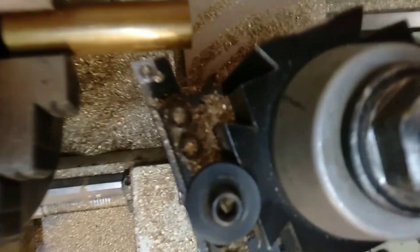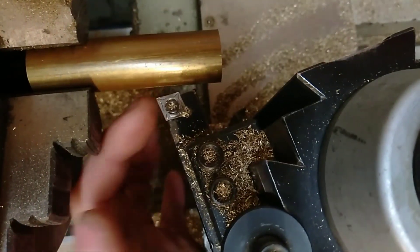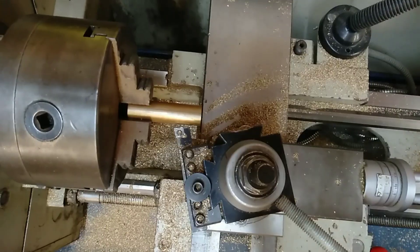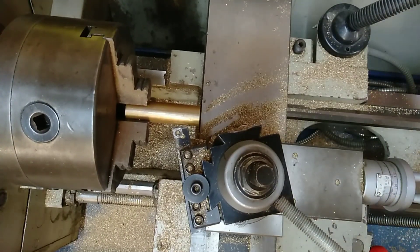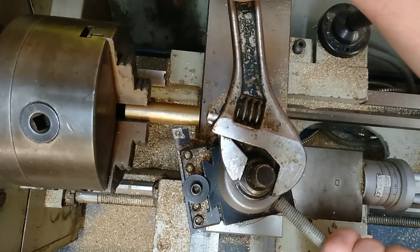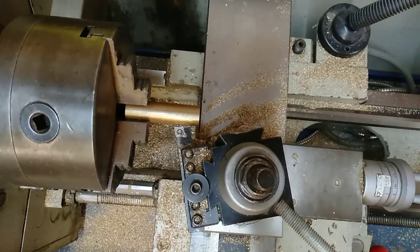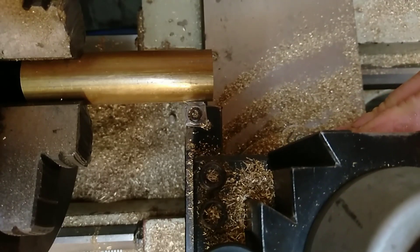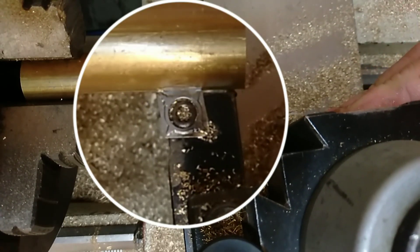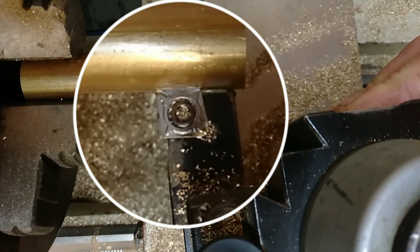Every time you do some turning on the lathe you want to make sure that you adjust the angle of the cutting tool to the process. You can see here that the cutting tool is not quite parallel with the work being turned, so you're going to need to undo the nut to adjust that angle. With the nut adjusted you can then adjust the angle of the whole turning post holding the cutting tool and move it one way or the other. For turning the diameter down you want it dead parallel, so you should not be able to see any light coming through between the cutting tool and the work being turned.